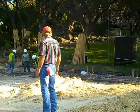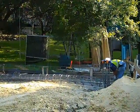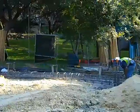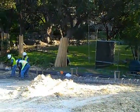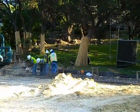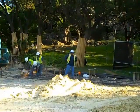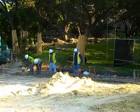The idea on this house is that it's basically sitting on stilts. These piers are going all the way down to the rock — we're bypassing all the bad soils that are in the way, and the house is basically going to sit on rock. Pretty amazing foundation. This type of foundation and the slab type foundation that we're going to show you in another video are really the two main types of foundations you see here in Central Texas.